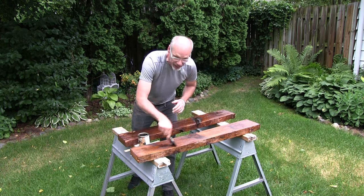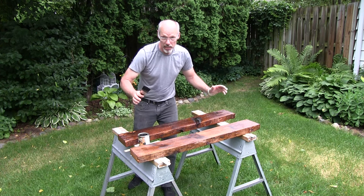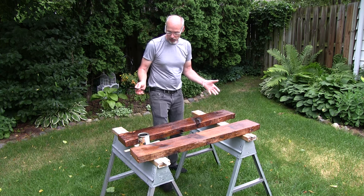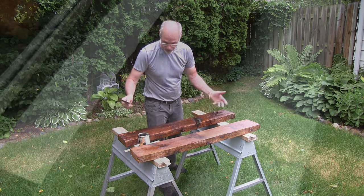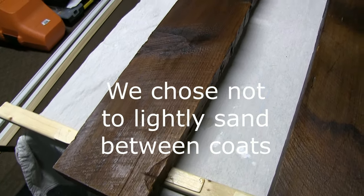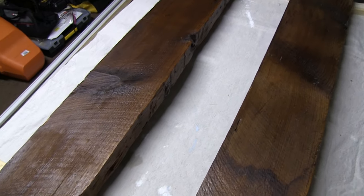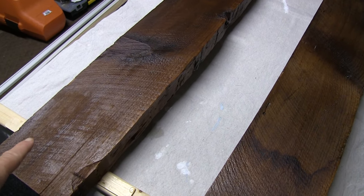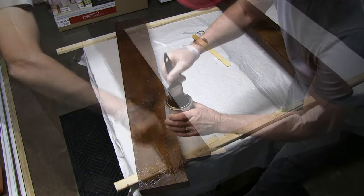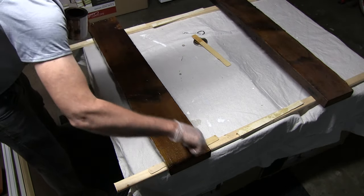Because I've got so much here we're going to wait overnight. It says when it's dry you're supposed to just lightly sand it and put another coat. I think I'm just going to look at it tomorrow and determine if I want another coat — I just love the look of it right now. Instead of being uniform and shined across, you get blotches if you go back over it with the brush. You have to stay in one direction and be uniform with it, or you'll get some of these blotches. I think we're going to have to go both ways to get it in.